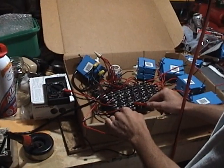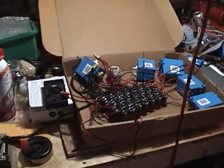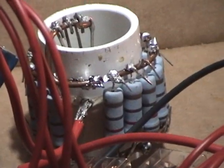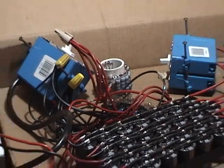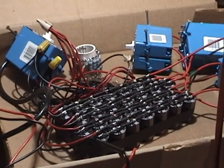This is our coil gun, which we built for fun — little other reason to build it. It plugs into the wall there, and right there is our charging resistor slash rectifier; the diodes are inside, you can see their tails right there. That goes to this whole mess of capacitors via our bank of relays, which are right there.